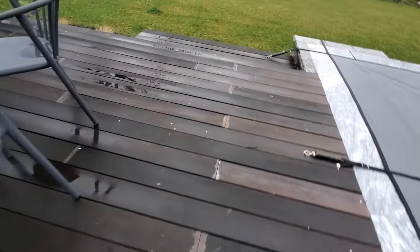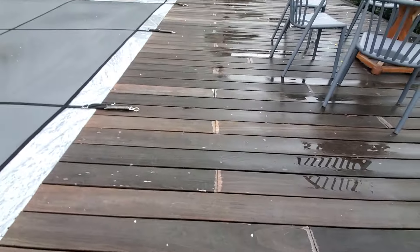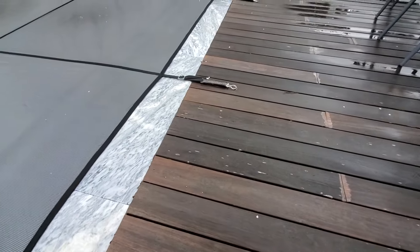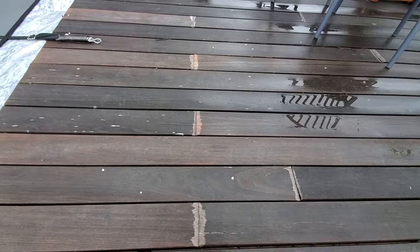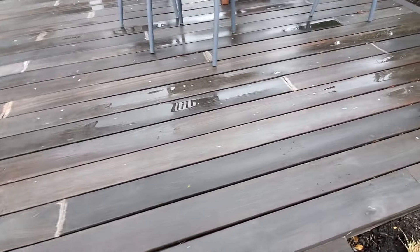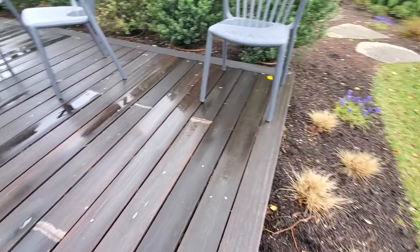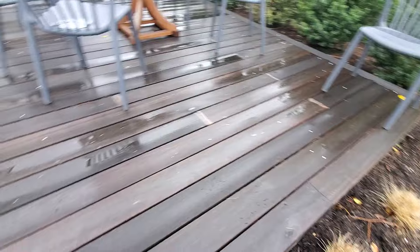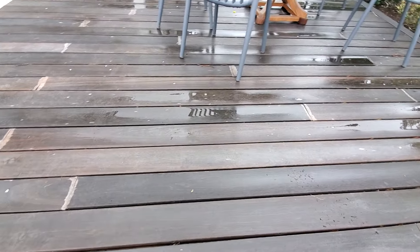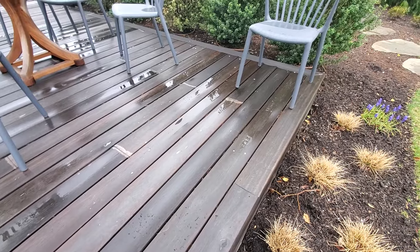Here's the synopsis of how we fix this: stainless steel screws in perfect alignment on the joists. Use a countersink bit that will accept the plug. First put the screws in after the wood has dried out, then let it dry again — let the sun react to it and let the tension build.